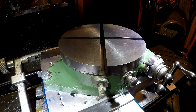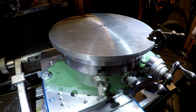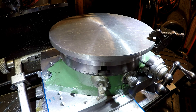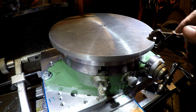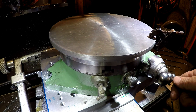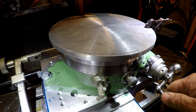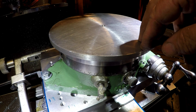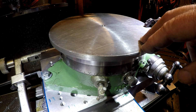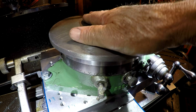Back at the rotary table here — five-eighths hole. Just to give you a little show of what the setup is when I was planning: there is the five-eighths gauge pin right there, that centers it right up on the table. Got my hole up top here which will be threaded. I've created this lip so I can actually clamp material if needed, and it doesn't hit anything. So I ended up with eight inches out here. Now I need to make my pin for the center, and then I'll do any other work right on the rotary table.